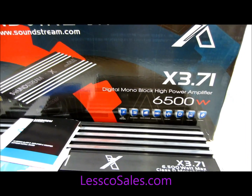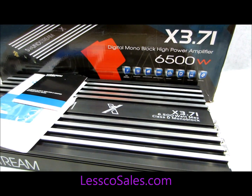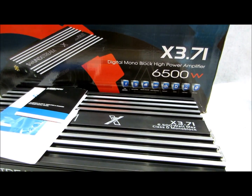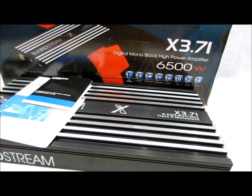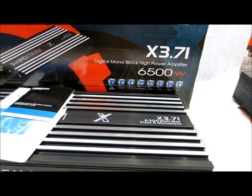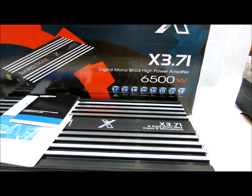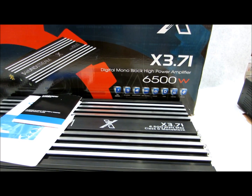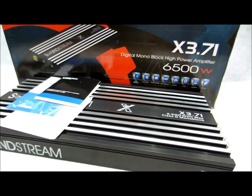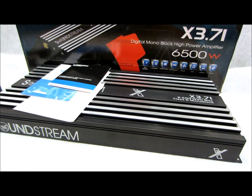This thing is really amazing — it's just scary to look at, it's nasty looking. This one is a 6500 watt amplifier, and of course that's at a three-second burst. Unlike the X360, which is the 4000 watt step-down piece, this is the big brother: 6500 watts in a three-second burst, one-ohm stable. 4650 watts at one percent THD, 4780 at five percent, and 5180 at ten percent. We're talking subwoofers, subsonic, pain-creating amplifiers.